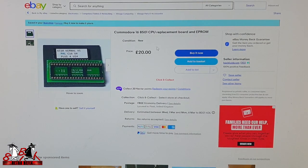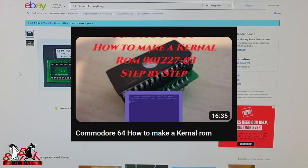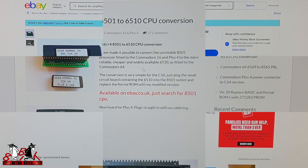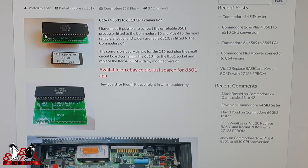That's the kit I physically have — I bought the board separately and showed you that in the previous video. The kernel ROM you can get from hackjunk.com, so you can burn yourself an EPROM. If you don't know how to burn EPROMs, take a look at the video where I did how to make a Commodore 64 kernel ROM — it's exactly the same process. I'll put a link up to that video. So what it says is basically you solder the pin headers across the bottom, put yourself a socket on, and plug your chip in.